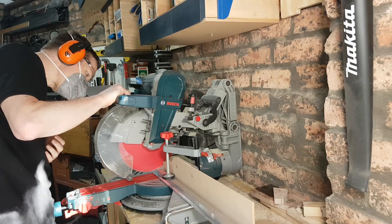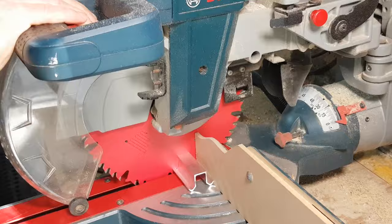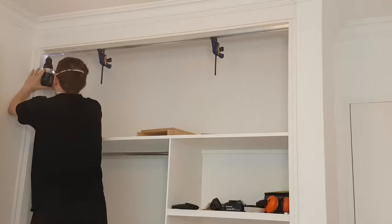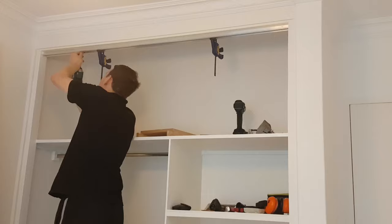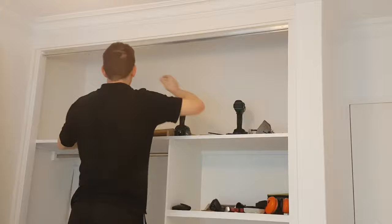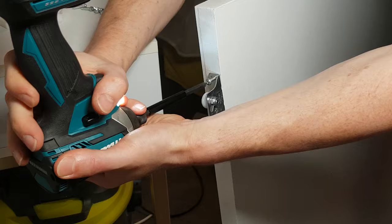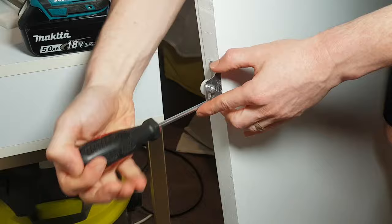Now to finally install the rail. It was aluminium so I popped downstairs to the mitre saw and taking it very slowly, used my regular wood-chopping blade to get through it. I took the same amount off each end to preserve the balance of the screw holes. And just because I don't trust anyone or anything, I added my own extra screw holes in between the supplied ones to give extra strength — it says it can take 25 kilos per door, but my doors were 20 kilos each and I was approaching that maximum weight, so better to be safe than sorry. Make sure you measure really carefully when installing these rails — give yourself enough room for the door mechanism to move freely. I had to adjust mine a little bit. Then we could screw the wheels onto the top of the doors — luckily these are all adjustable in both height and position after you put them on.